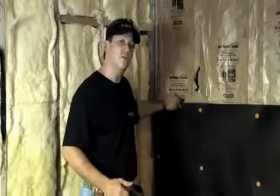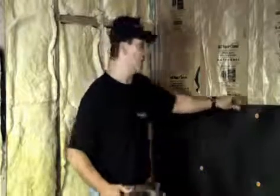Always make sure that there is a flexible amount of Acoustiblok between the positions that you secure it. By doing this, you allow the material to move internally within the wall, and you're not compressing it. Your results will be greater.